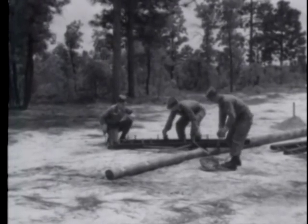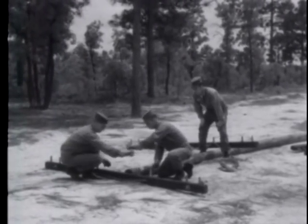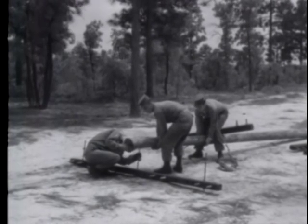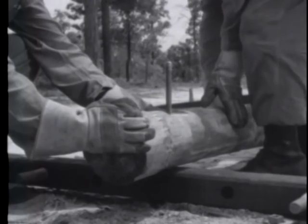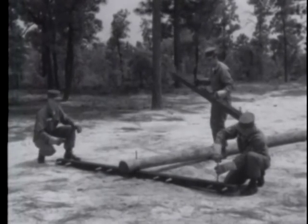Now you are ready to attach the cross arm, which has been equipped with B-bolts, to the pole. Feed another B-bolt equipped with flat washer and nut on one end through the cross arm. Then use the B-bolt as the through bolt and feed it through the hole in the pole. Now you can place the other cross arm on the other side of the pole, passing the bolts through the prepared holes.